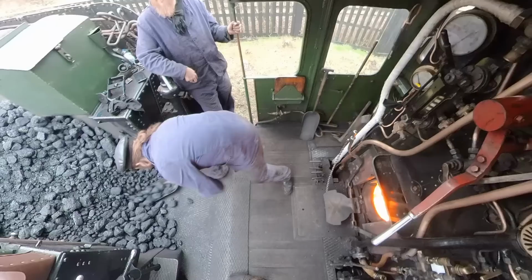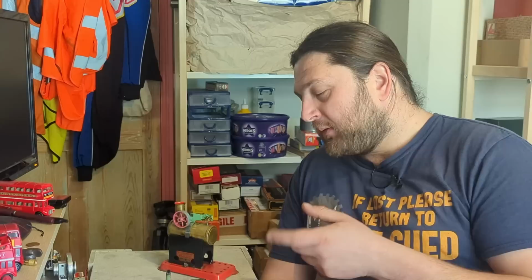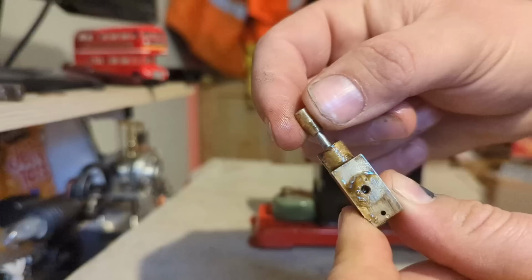And there's a whole host of other things which we can get steam to do to make an engine easier to use. This has none of that. Because this, as I've said, is beautifully simple. Because this shows us the principles behind a very simple steam engine. The principles which are basically the same on a larger engine that's done in a more complicated and more efficient way. Particularly when you have your valve gear and you can actually make a cylinder push and then pull itself back in and getting two strokes rather than this one that just goes once.